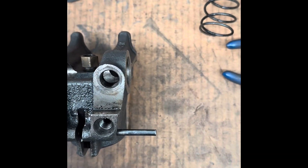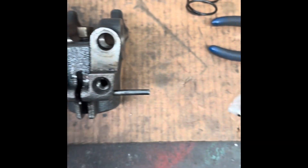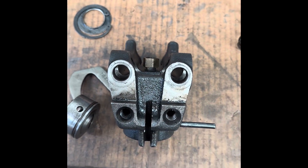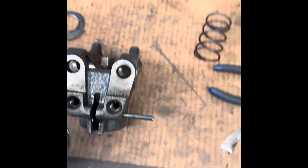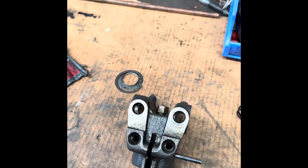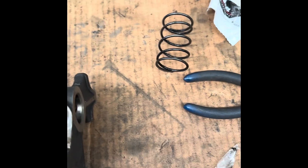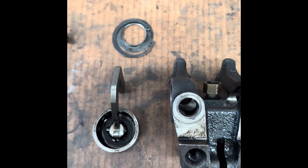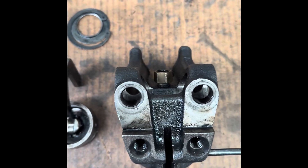All this is a modulator. It controls the racks going in. As the turbo boost comes on, the piston comes out and lets the racks go into full fuel. They're usually on high horsepower engines — 475s and that sort of thing — just to control the boost.